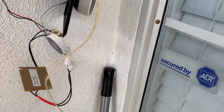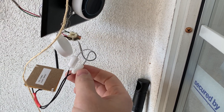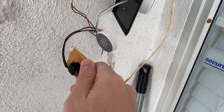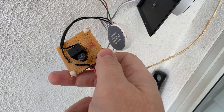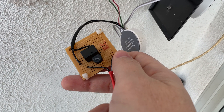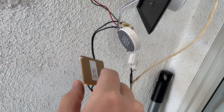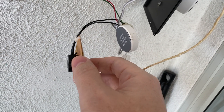This little circle had two wires coming off that you could clip directly into. I had to purchase this little unit — a DC relay, an AC/DC converter — that I found from another YouTuber. I can add the link in the video description. What you need this for is it converts the power coming from the transformer into this relay to trigger the switch for the chime box, so you can still keep your original Nutone equipment.